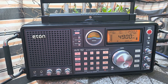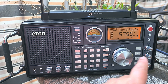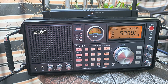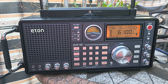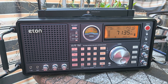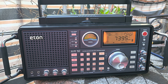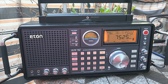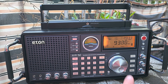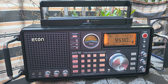One very important trick here: if you want a good ATS scan on this radio, use a narrow filter and make sure the RF gain is set to a proper level depending on whether you're using an outdoor antenna or the telescopic antenna. If you're on the telescopic, you can probably leave the RF gain at almost maximum. But if you're on an external antenna because of overloading, make sure you lower the RF gain a little bit or use the attenuator. Also, make sure you don't use the wide filter in the ATS scan, because if there are several stations they'll be logged as one station.